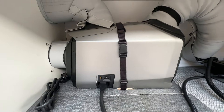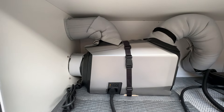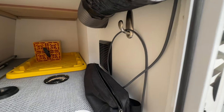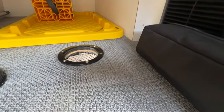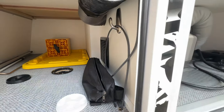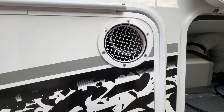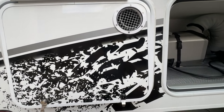The left side vents are the air exchange vents for outside air — they go back into a rear compartment. This compartment is drilled out on the bottom for return air, so this will be outside air intake into the six-inch vent that goes into the air exchanger inside. Then the hot air will exhaust through this hose out of the vent that I put into the exterior door. That pretty much wraps it up.